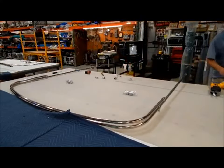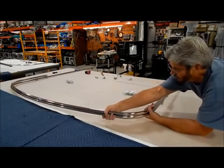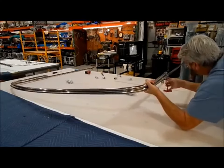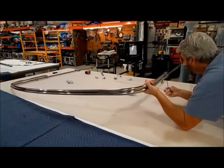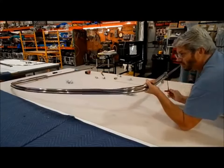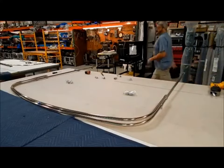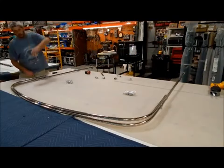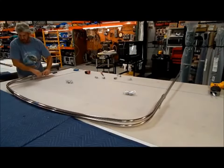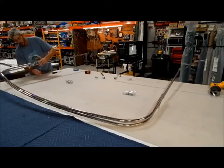Get it to nest correctly, or you don't know where to set this, line your bars up at the top, and that's where it goes. Because again, when you put the boot on it, everything has to fold nice and neat, so all these poles have to line up with each other, because there's going to be a whole lot of canvas in between them. That's how you know the height of these jaw slides for your intermediate and your secondary bow. Everything has to nest right on top of each other.